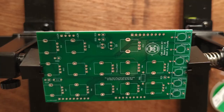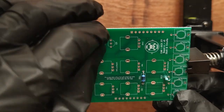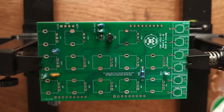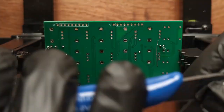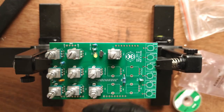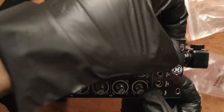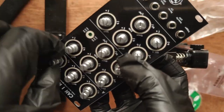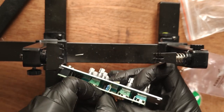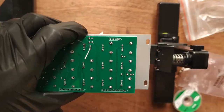Now place the front board. Place a 10NF capacitor, 1K resistor, 200K resistors, a 10K resistor, two 1K resistors, and the last 3904 transistor. Solder all into place. Place the LED but don't solder it. Same for the two A100K potentiometers and 11 B100K potentiometers, and 6 jack sockets. Position the front panel and hold it in place with some nuts. Cover the LED hole with sticky tape and wiggle it into place. Fix the module by the front panel, then solder all joints.